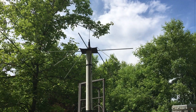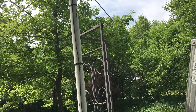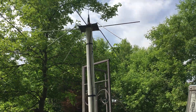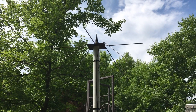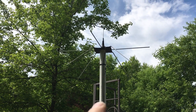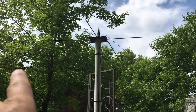I cut a new antenna for it and got it down to 1.079 SWR, which is really good. Now, you can buy a ground plane kit for your mobile magnetic antenna for around 30 dollars and up, but I did this a little differently.